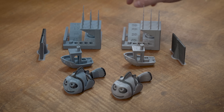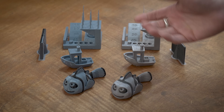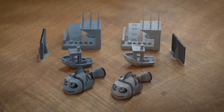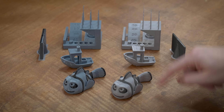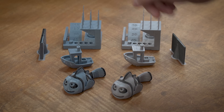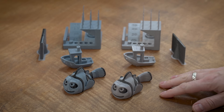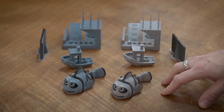For all of this I tried to use the same or close to the same print profiles for both nozzles. It is all 0.25 millimeter layer height, the same firmware, the same slicer, and the exact same spools of filament — four different rolls — identical for all tests. I went through and printed everything in 0.6, then changed the nozzle and did everything in 0.4.